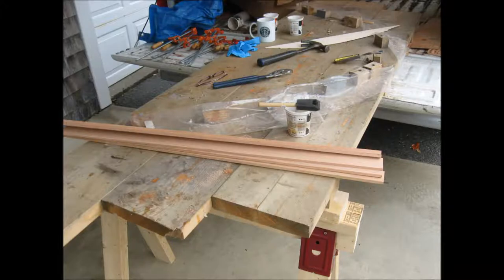Unfortunately, I don't have any pictures of the tear-apart process. So what I'm going to be doing is showing you the procedure of building new frame ends that are laminated to patterns to fit into the hull and replicate what I took out. Then I will show you the result of the new frame ends in the boat. This picture shows the framing jig that I built. It consists of three 2x10s with 2x4s on the back to hold them together.